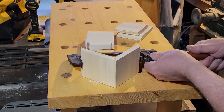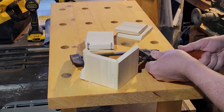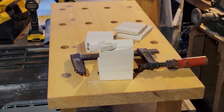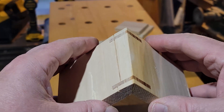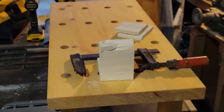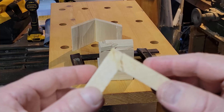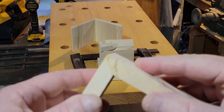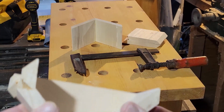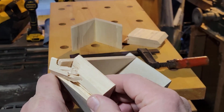You can see the wood bending — there you go — and as you can see, the wood itself broke, not the actual joint, which is kind of cool. Then the one that really matters — the reason why I decided halfway through that there's no real point worrying about strength — is the box with two corners. You can see it just crushes the wood; there's no damage whatsoever to the joint itself. The actual wood gave way and fell apart, but the joint is completely solid. The miter joint with splines also broke in the wood, not along the joint itself — so yes, splines do add strength and they look nice. But none of them compare to the box with the recessed bottom, which crushed completely but the joint is still rock solid. Anyway, thanks for watching, leave comments, let me know what you think, and I'll see you in the next video — bye for now.